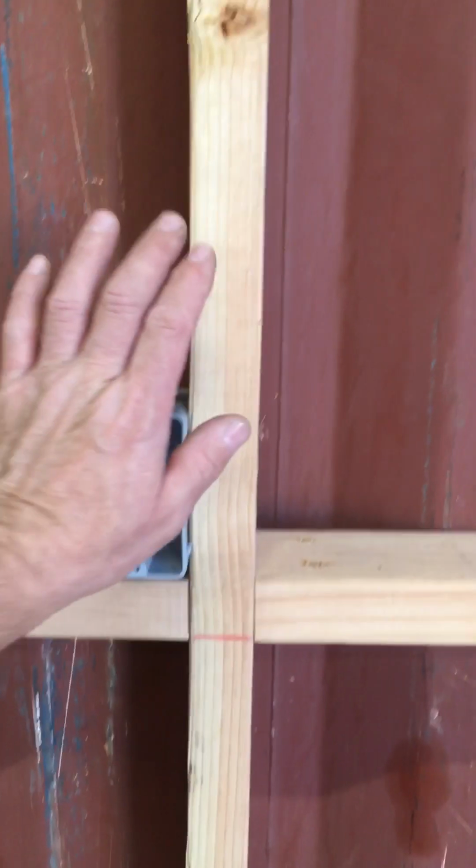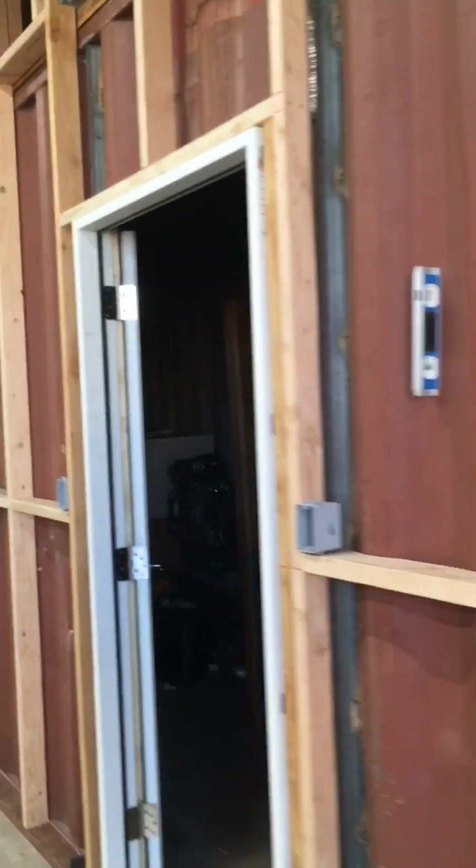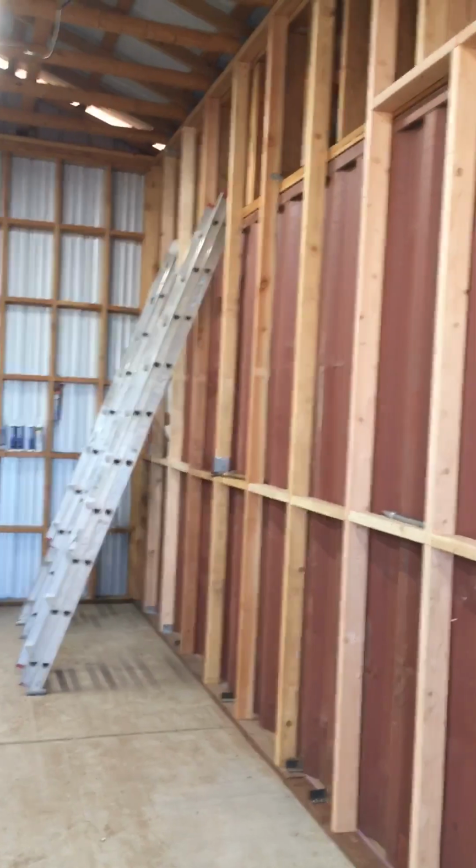You know, in homes, you're gonna do 1 foot off the ground, but out here in the shop, you're not gonna be reaching down there at 1 foot. You're gonna put everything right up here about chest level so you can plug all your items in, your toolboxes, your chargers for your battery operated drills and so forth. So try that, and remember, no more than 8 plugs on a 20 amp circuit.